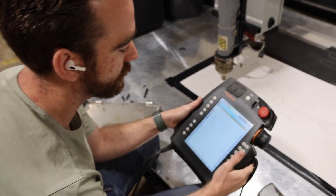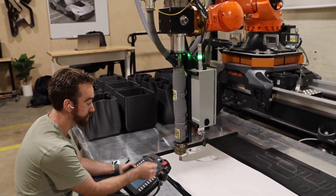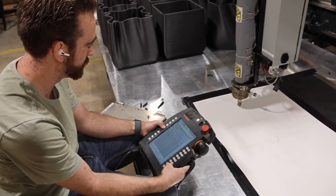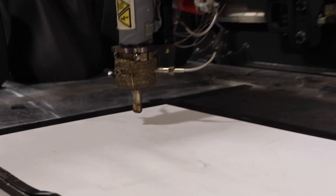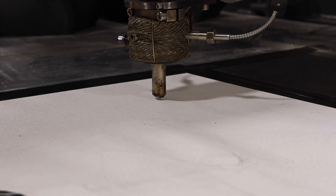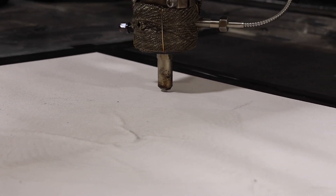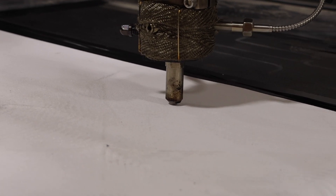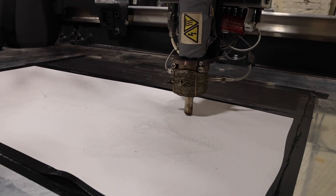Now I'm just doing a test trial to see if it runs in the right location. I adjusted the Z offset one millimeter up higher and moved it back 200 millimeters because that section's a little more flat. The vacuum table doesn't suck hard enough, but I think we're good. This is testing the file without extruding — it looks to be in the right place.